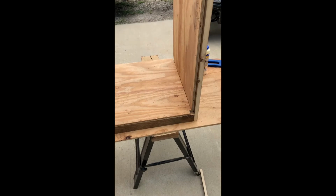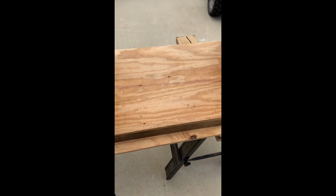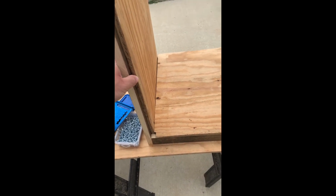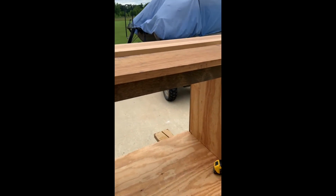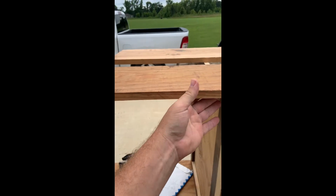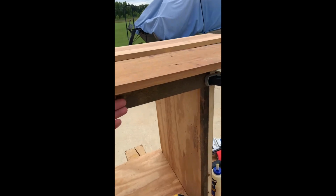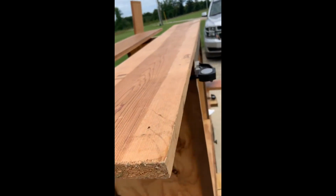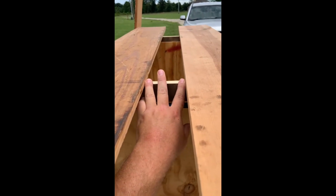All right, I'm going to go ahead and tack that floor down in there. And I'm going to get these strips cut, get the strips put in, and then we'll start thinking about the backing and the tabletop. Last little bit here, we'll work on the top. So I'm going to obviously cut these. They're going to hang off about 1/2 inch on either side and 1/2 inch on the front. Be flush on the back, and then I'm going to rip a board off of that one standing up over there to fit in the middle.